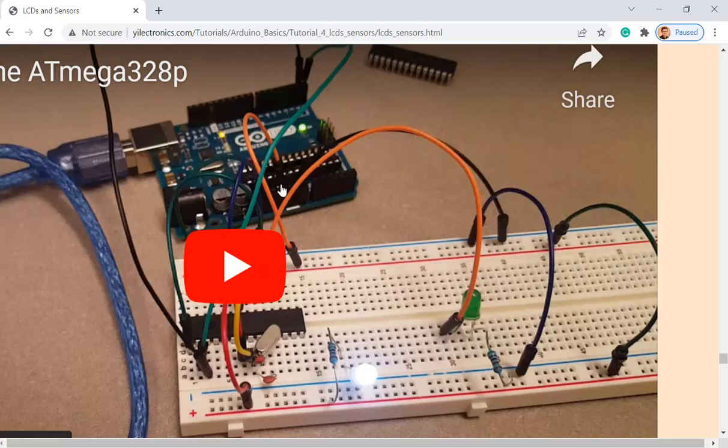However, after I design a PCB, I solder all the chips to the PCB, but I found some issues. I want to re-upload some new program to the chip. Oh, what should I do? Just something like this, right? Take out the chip from the original Arduino board, just use it as a programmer, and make all the necessary connections to the chip on your application-specific PCB, so you can program it outside of the Arduino board. It's directly from the Arduino board to your PCB.